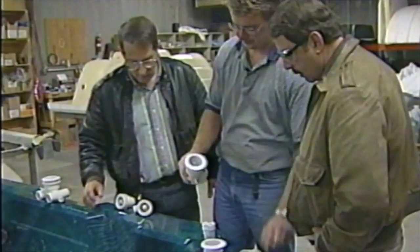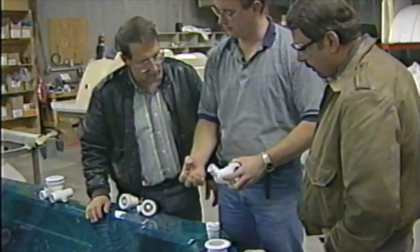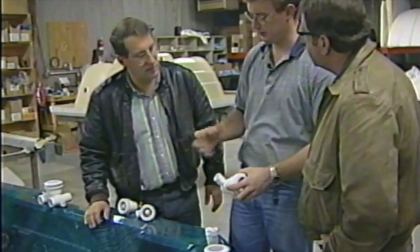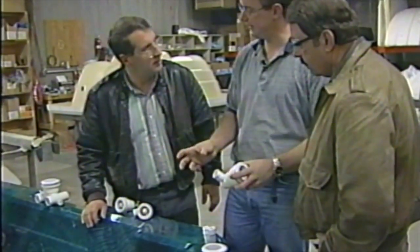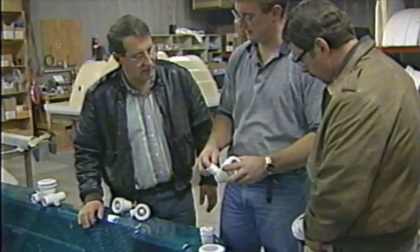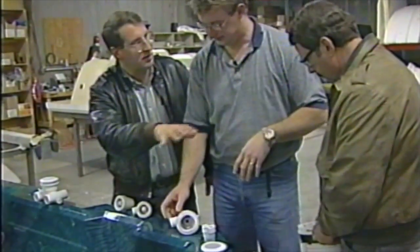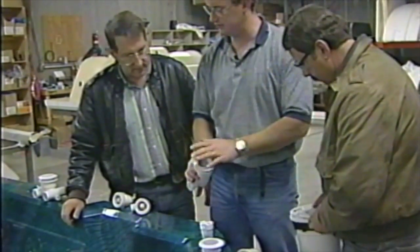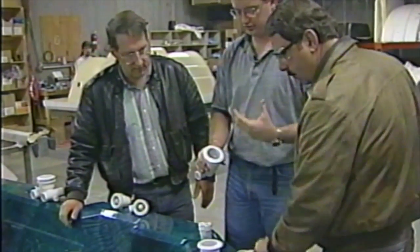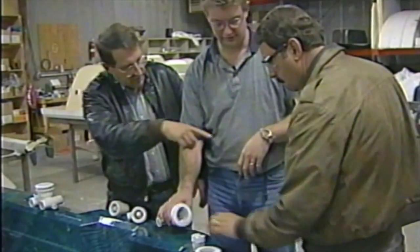They're made for us by a company called Waterway, but it also runs off a manifold system. When we start plumbing in a minute, I'll show you how that works. We're going to run the main line around and then tee off into the manifold. That keeps equal pressure going to all the jets. We want to make sure we have 30 gallons of water coming out of each jet so that we have good hydrotherapy. Now, what's this big thing that Stan's got?